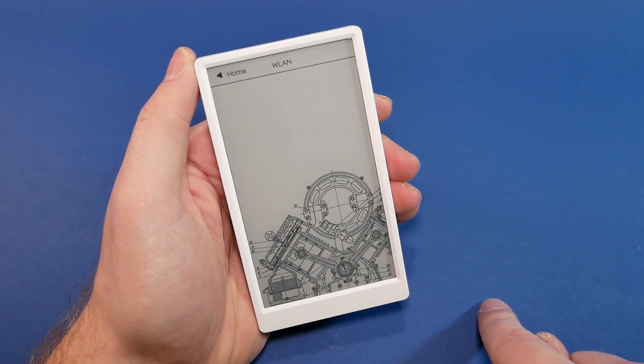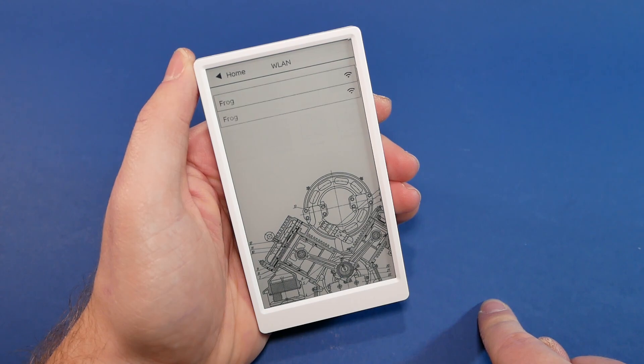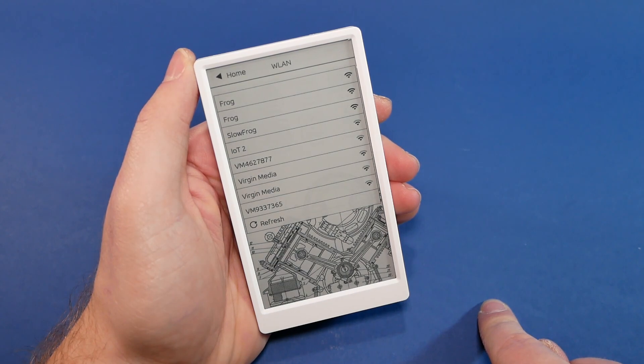If that's not enough, there are two physical buttons, one of which looks like a really cool rocker with a button function. There is a micro SD card slot in case you need storage, and a couple of sensors inside including temperature, humidity, and RTC real-time clock. You can use that RTC to enable a very low power sleep policy and only wake up the device when needed, taking advantage of the e-ink display that always shows the information you need on screen.